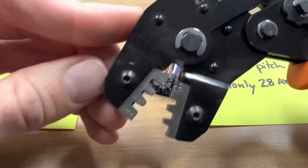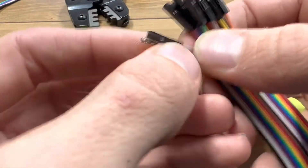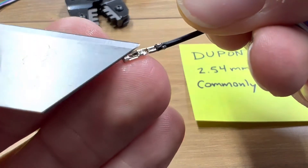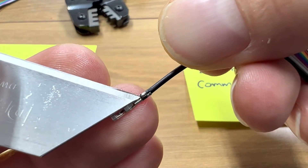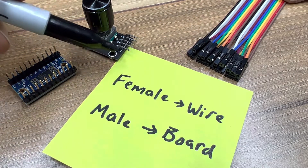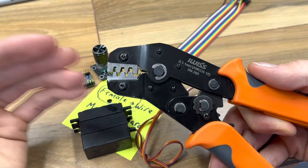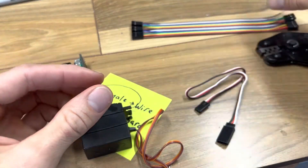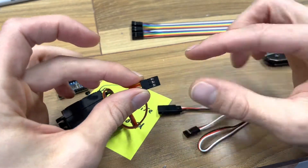This looks intimidating but it's really easy to make these crimps. Pay attention to that shelf there. If you grab your wires and remove the housing, you'll see this kind of assembly — right here is where the conductor copper stops, and right here is where the insulation stops. Make your life easy by using the female terminal on the wire and the male terminals on the board. That means we're going to crimp with the female. This is the same crimp, by the way.